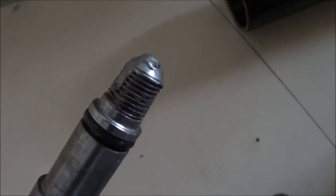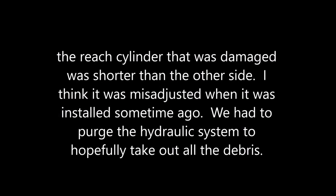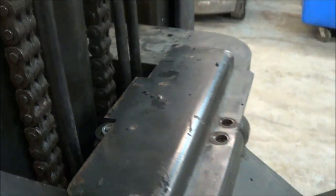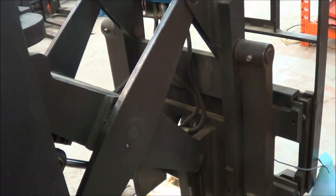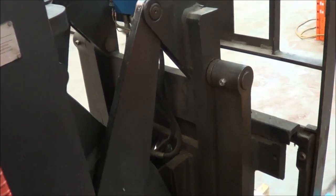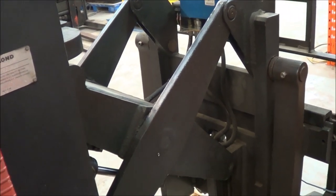This is where the metal debris on that one-way check valve came from. Since we don't have the parts right now, we decided to clean the one-way check valve and made sure there's no more metal debris. And this is how it's working now — tilting up, tilting down, reaching back, reaching forward. That's it — we call this a fix.